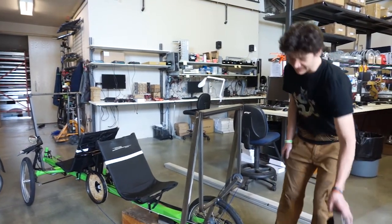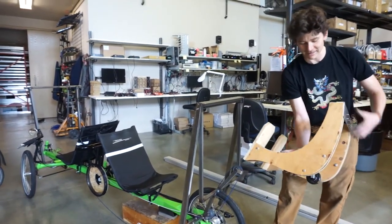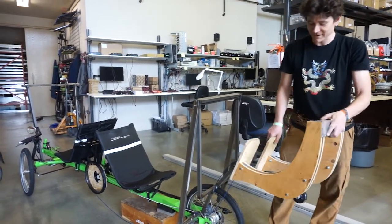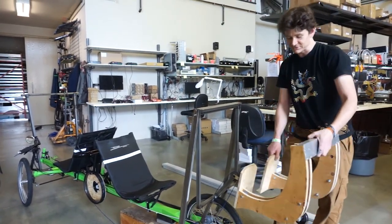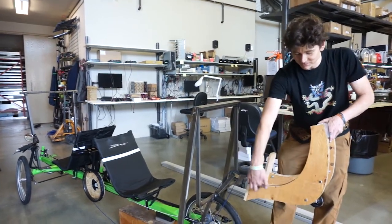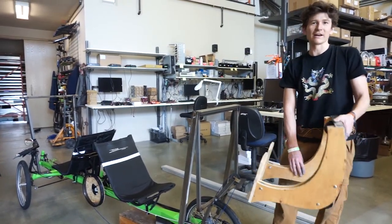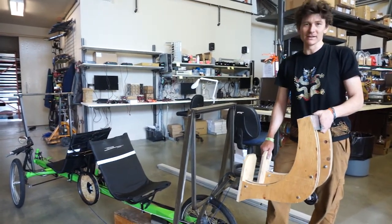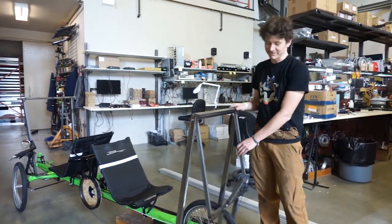When you have a linear slide like this, especially since I have to have two rails on either side, it ends up being a lot of rolling contact points. So I actually have three caster wheels on each side of this, six in total, but that didn't provide any side-to-side wheel support. So in order to have this go back and forth smoothly, especially given the sort of sideways torsion that exists, given that the cable pulls off on one side, I've also had to have a series of wheels on the inside and outside of the rails, and all told that would be 12 points of rolling contact, and I wasn't really that comfortable with how long-term reliable a linear slide mechanism like that is when you compare it to just the pure simplicity of a single pivot from up above.